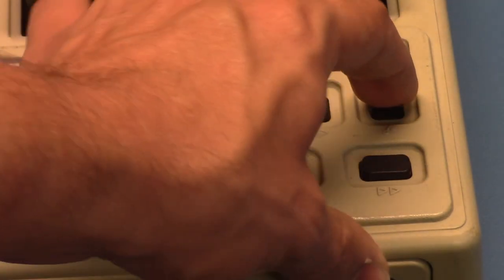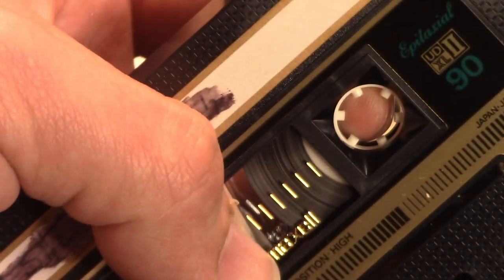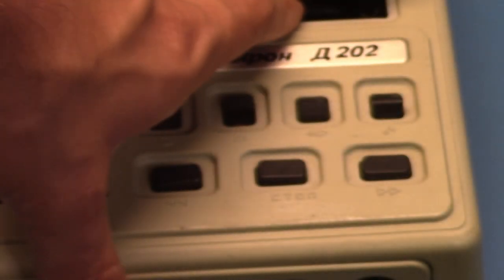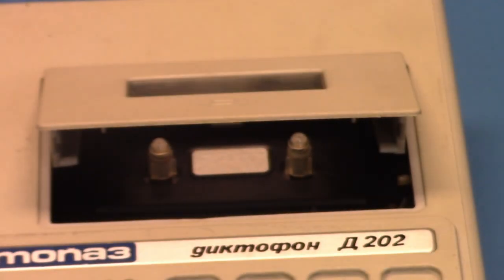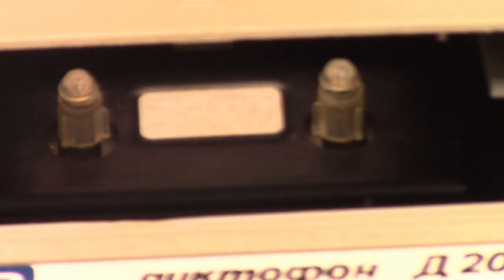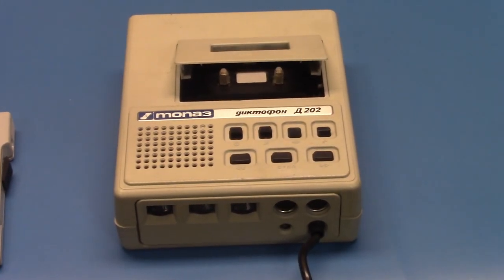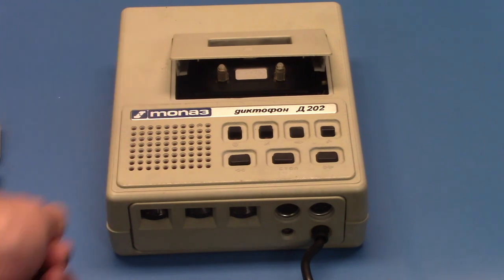And then here's your eject. What was happening before with the eject, the cassette got stuck. The bottom of the actual wheel inside the cassette, the spoke, caught against the top cover on the spindle, and it was catching and making it not want to go either up or down. It was quite frustrating. The first time that happened too was, of course, on video. Of course, then again, I never just ejected, closed it, ejected, closed it over and over again until I showed it on the video.